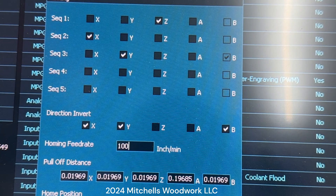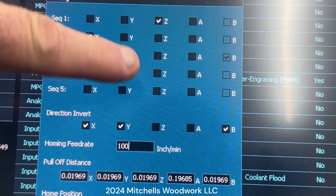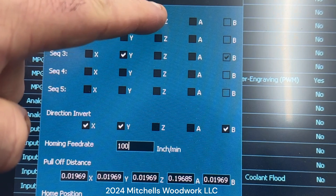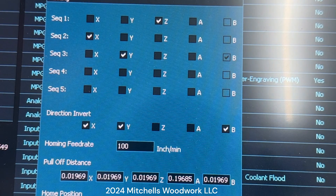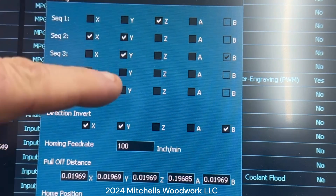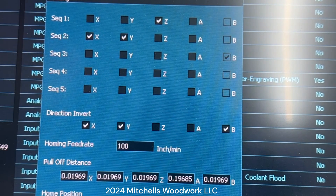That's a big improvement, but you still have this issue where each axis is homing independently. It doesn't have to be that way. Your Z needs to raise up first — that should always be first — but for the second step, there's no reason you can't bring the Y up and home the X and Y at the same time. Mine has been doing that almost since day one, and it basically cuts your homing time almost in half.